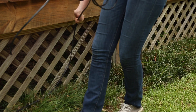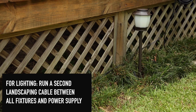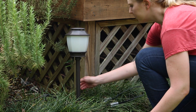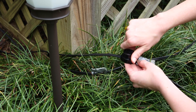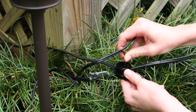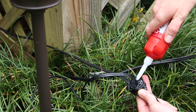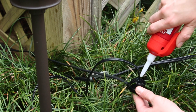To connect the wiring for the lights, follow the same path and run your second landscaping cable between all fixtures and the power supply. Label this cable as LED light. You will make electrical connections using the connectors and adapters in the same way you connected the repellent. The tinned ends of the wire from the fixture marked LED light will be inserted into the openings on the upper half of the connector just as before. Be sure they are secure before you apply the dielectric grease to the holes. Now repeat these steps for each fixture.